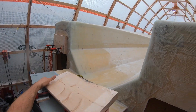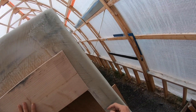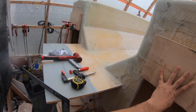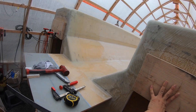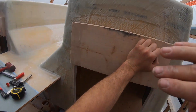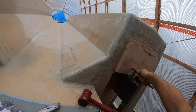What I'm gonna do is put this two-by — I think it's a two-by-ten — I'm gonna clamp it against the wall here, just like I did the other side. I'm gonna line up the edges at the 500 millimeter mark right on the edge of my cut, so everything should line up properly. Then from there we're gonna try to glue the side pieces on — not sure if we're gonna screw them in or clamp them — but this should hold everything nice and plumb for us. Once the side pieces are in place, we can add the bottoms and the fronts.